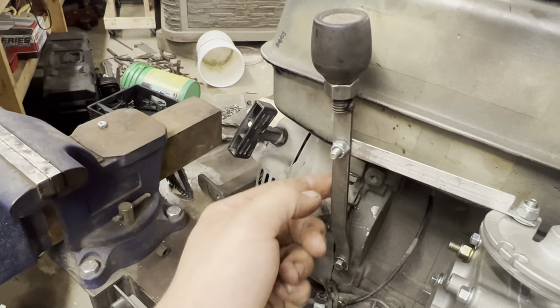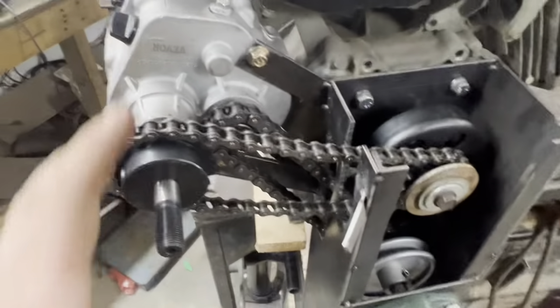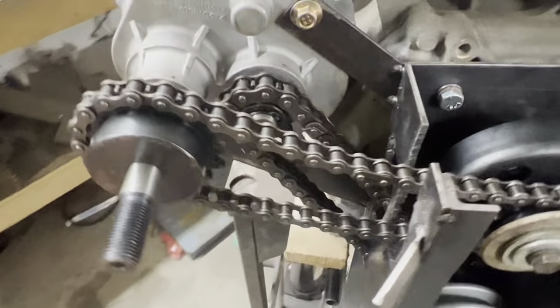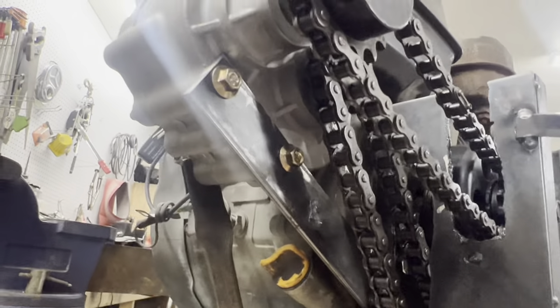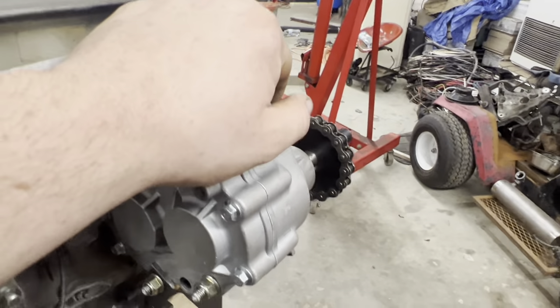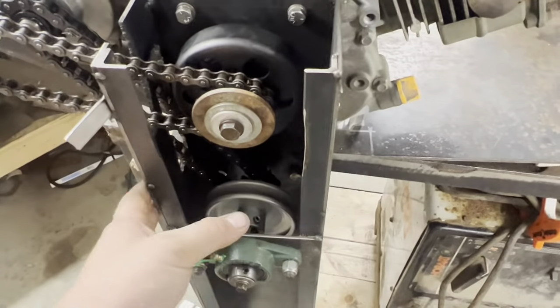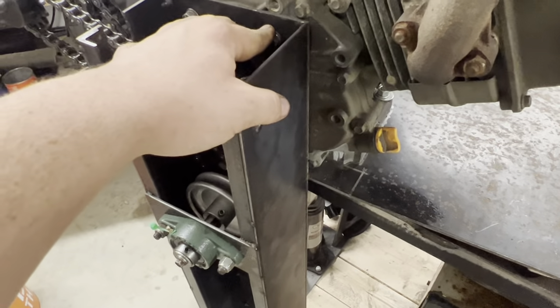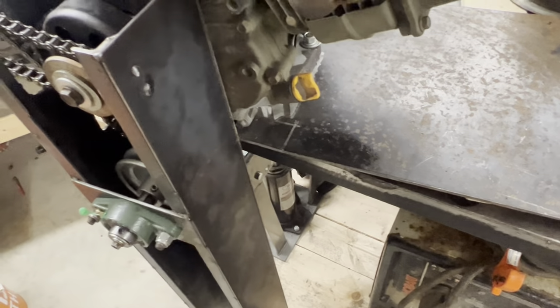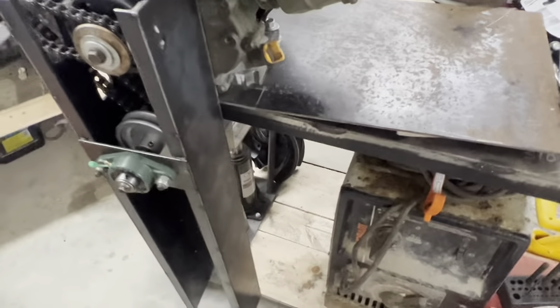It's quite easy to operate - just a bolt welded onto a piece of flat steel. The actual gearbox itself, the way I bolted it on - I set it in place and you can see the piece of flat bracket here that I tacked on, and there's another one that runs up to those two bolts. That was the first one I mounted and centered everything off of. Then there's this one over here that goes from that with a little twist into it down to the bottom one, which reinforces this. I can move the whole motor with just the gearbox - it must be quite strong. This hasn't even been welded onto the steel plate yet, it's still just bolted onto the motor. At some point I'm going to end up welding it top and bottom.